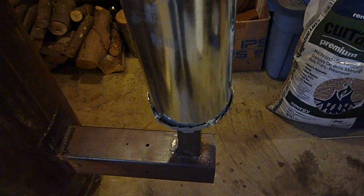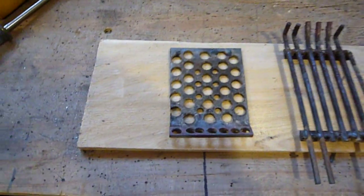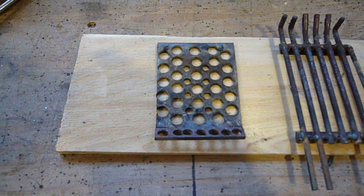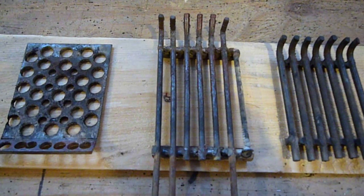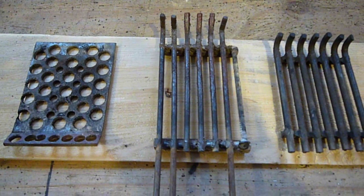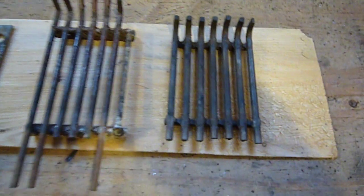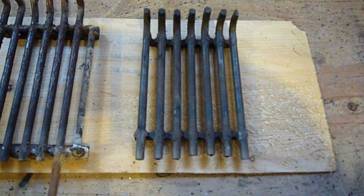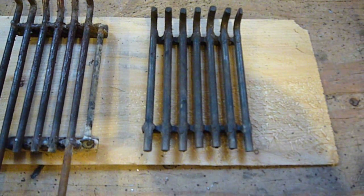My sheet metal scales are not too good. This perforated burn plate will run 450 degrees. This first wire plate in the center ran quite a bit hotter — it's bad steel, got flaky, and blocked the pellets from falling through. This last burn plate here is the wire from an old oven rack. It's a higher quality steel and it stays smooth and it runs pretty good.